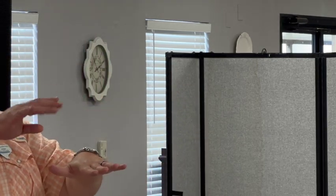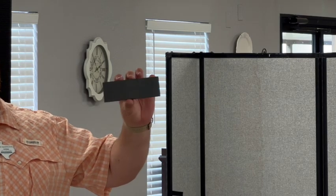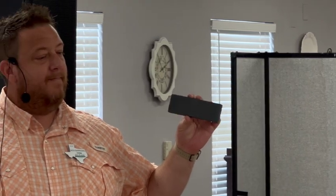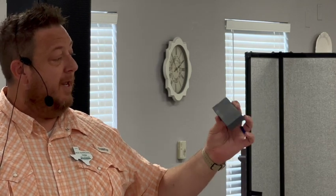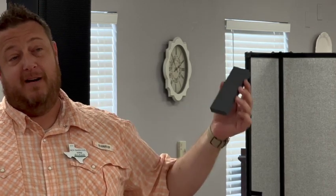The wet stones — you'll know if it's a wet stone because you probably bought it for sharpening your kitchen knives. Those get soaked. When you put them in water, they actually bubble and you can see all the air coming out of the stone. This one here is more of a natural stone. The Arkansas stones are natural because they actually cut those out of the ground. This one is a man-made stone — I can't think of what it's called — that you would use oil on. I've tried it with water and it works okay, but it works better with oil. It has a coarse side and a fine side.